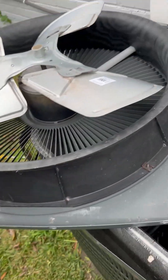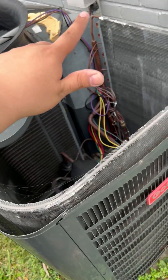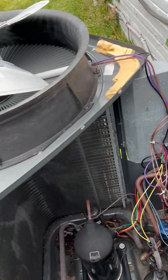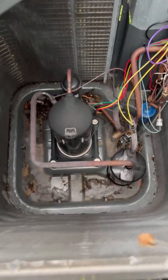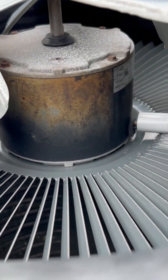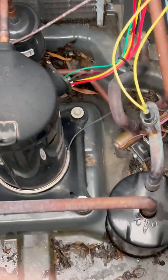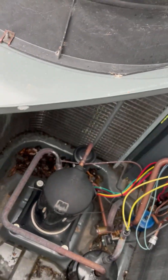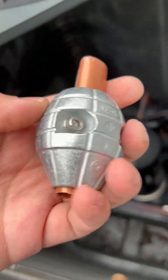Now that you've taken the top off, you can fully disconnect it by pulling those wires through. Typically they'll be attached by a zip tie to your condenser coil, but I just pulled it through enough and set it aside. As you can see, the fan is getting a lot of rust — it's an older unit — and there's some rust on the piping here on your suction line pipe. To prevent any future rusting and save your system, giving it some longevity to last longer,